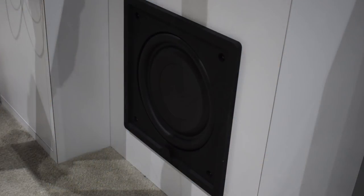So now I've EQ'd the listening position for that subwoofer. My problem is I wanted to apply that technique to this in-wall subwoofer. I don't know what the response is because I haven't designed the box, I haven't designed it as a system, so I can't actually apply that technique. Then I thought of something. For the last 30 or more years, whenever I design a speaker, I measure or confirm what the low-frequency response is. That's the most difficult thing for people to measure. Anechoic chambers — very few people have access to them, and they're really not big enough to measure subwoofers anyway, so you use the near-field measurement technique.